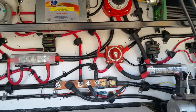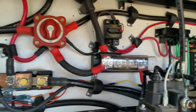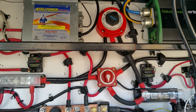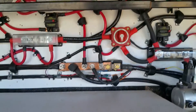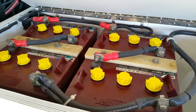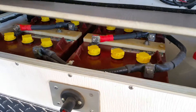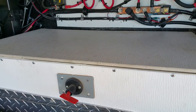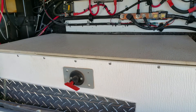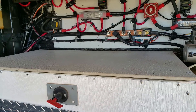We run twin battery banks. We have two of these catastrophic fuses — one there and one there — so I can run both of my inverters off both battery banks, or I can isolate each one individually. Here's my first battery bank: it's 450 amp hours of T105 RE batteries, wet cells. I made the box — if I had known about the plastic boxes when I built that one, I might have ended up putting one of the manufactured boxes in there.